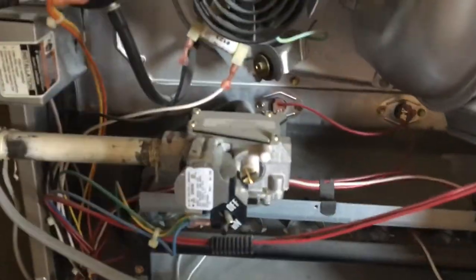We're going to be installing the new capacitor — this big nasty one — and also putting on a new hard start because the in-rush test I did on it was 183 amps. 183 amps — that's a lot. We're going to put that on and see what we can get it down to on startup, and hopefully take some of the wear and tear off that unit. Let me finish putting the furnace all back together and then we'll get the outdoor unit back on.